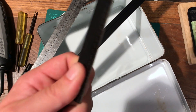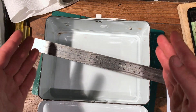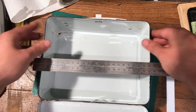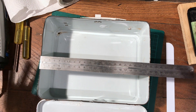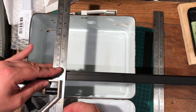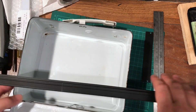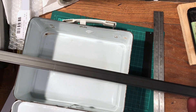Can't stress enough the old adage: measure twice, cut once — probably measure about five times. The nearest even HP width my case comes to is 42 HP. It's a little wider than that; I've taken the decision it can bend in a bit, but if it bulges out the lid won't shut. Really it's 43 HP but I don't want to put one HP in there. You can use a pen to mark where you want to cut, or the more accurate way is to use a scribe. Use a square — there's a little bit that unscrews which is a scribe — to get a perfectly square scribe line. Sanity check yourself; these rails are not the cheapest, so you don't want to be cutting them again.